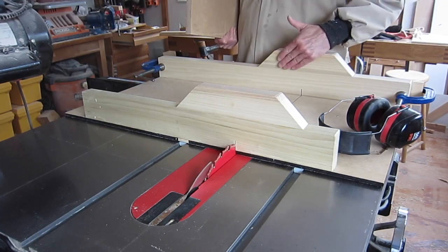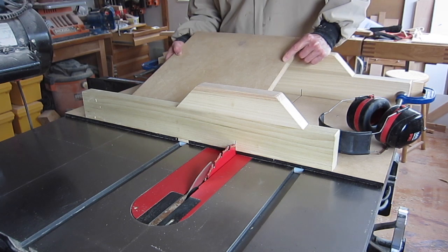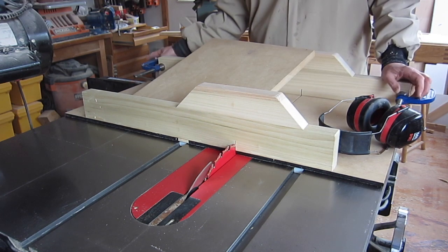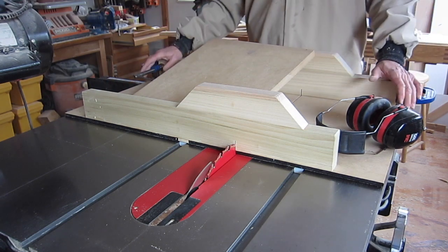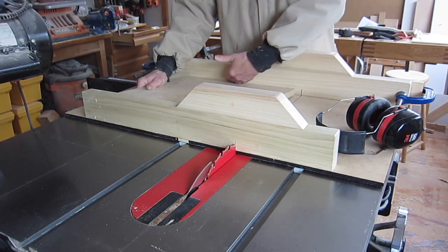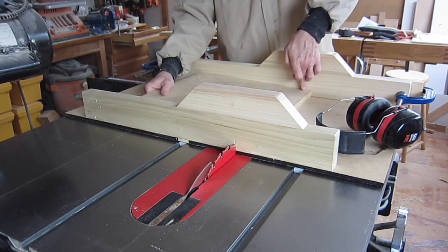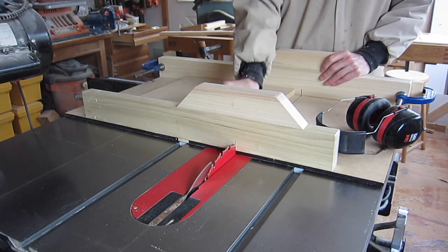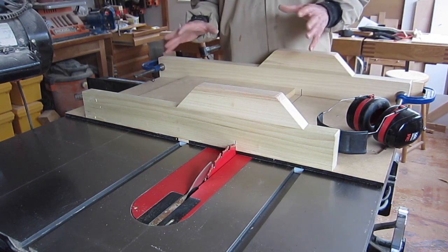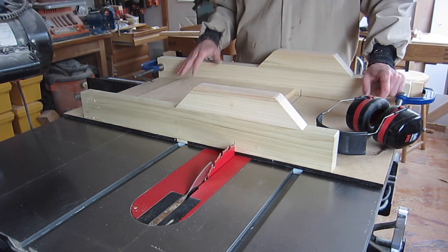The method I'm going to use to check the fence being square to the blade is called the five cut method. I don't know who first came up with it — maybe ancient Egyptians — but I got it from William Ng in a YouTube video he made in 2012, the same year Alan Turner published the clamping method, so 2012 was a good year for crosscut sleds. The five cut method involves taking a scrap of wood, making a cut against your fence, putting that cut edge against the fence, another cut, another cut, another cut, and then a fifth cut taking off a thin slice. If the fence was perfectly perpendicular to the blade, that thin slice would have the same width all the way along. William's video explains in great detail how it works and the formulas involved — I'll put a link below. I'm just going to go through the steps.